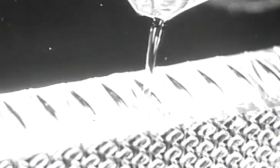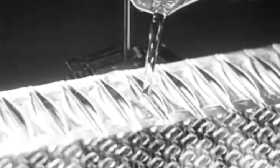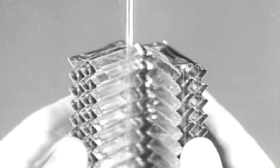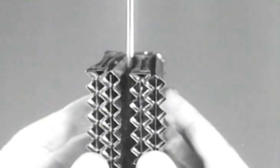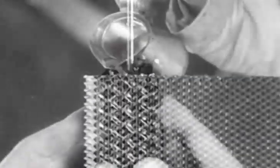The soldered block passes through the washing machine, there is time to explain how the cooling water finds its way through this metallic maze. Between each pair of loops, a water space is left, 3/32 of an inch in width. Through not less than 54 of these channels, the water flows from the top to the bottom of the block.